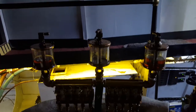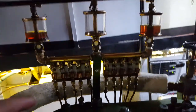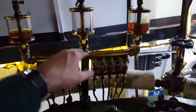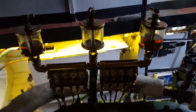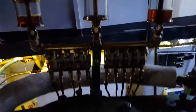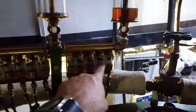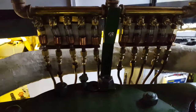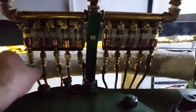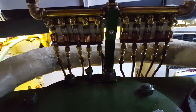I don't know how well you can see this, but this is a lubricator setup my dad made from 3/8 inch brass tubing and fittings with Lunkenheimer No. 4 oilers, with clear plastic tubing between the 1/4 inch needle valves and 1/4 inch copper tubing to the various bearings.